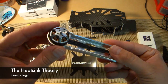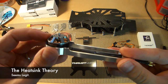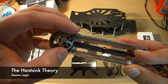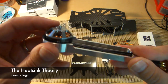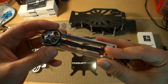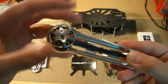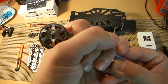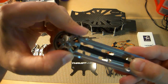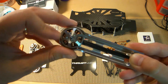I got a message last night from a club member about these motors. They were commenting on the fact that they're only 2,000 KVs and that on 4S these have a tendency to lose a magnet — get so hot that the glue gets soft and throw a magnet. Many of us are out there on G10 frames, and G10 is an insulator. So when you're popping the throttle and keeping heavy throttle on a 4S setup, all that heat is going to stay right there with the motor and start to cook those magnets. Eventually you will get some slippage unless you've got a really good quality motor.